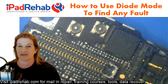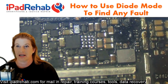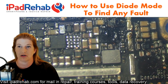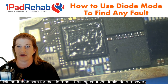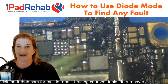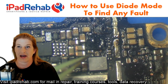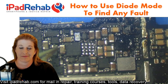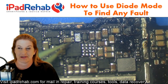I cleared out this connector area since the problem is no image. When I got it this morning, it had a VCC main short. The prior technician had taken off both backlight drivers — that's about all he did to troubleshoot it. Over by the TriStar chip there's not much water, but down further it's saltwater hell. I cleared the VCC main short — it was under chestnut, and a cap next to chestnut was also really corroded. I replaced chestnut and put back one backlight driver.